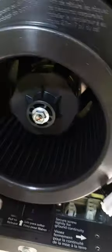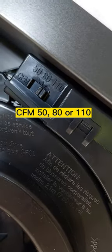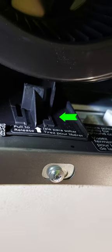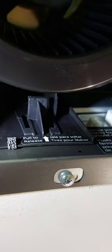You're going to do one plug for the blower and then check the speed that you want on your fan before you put the cover on. You're going to do the same thing with the LED — select the color temperature you want. Make sure the fan spins and don't put pressure on it. That tab right there you're going to use to remove it later on. It gets a little stuck when you're pushing it in the slide, so go ahead and jiggle it and pull it a little bit. It tells you right there what to do, and once it locks in, it locks everything in. So you've got the screws and you've got the plugs.